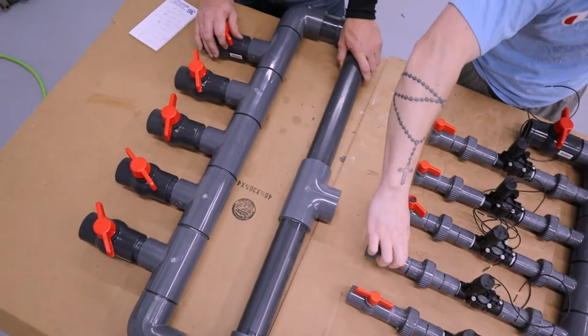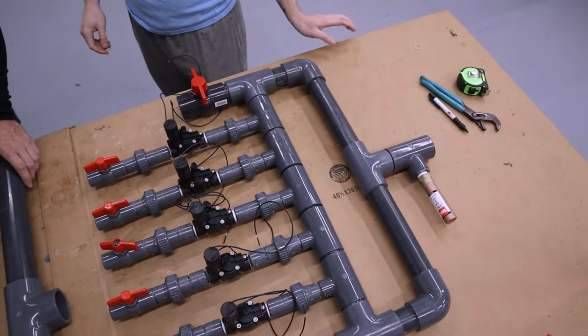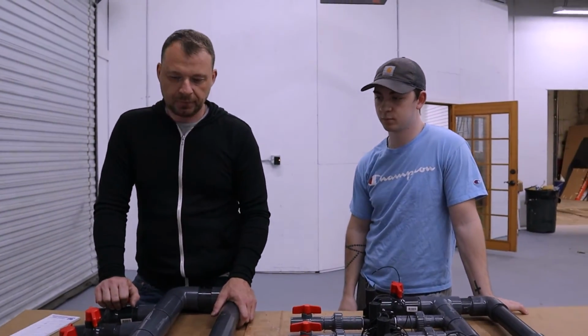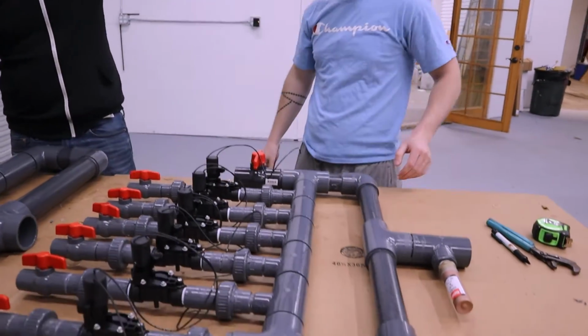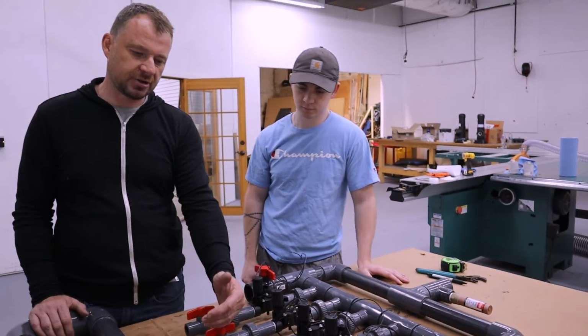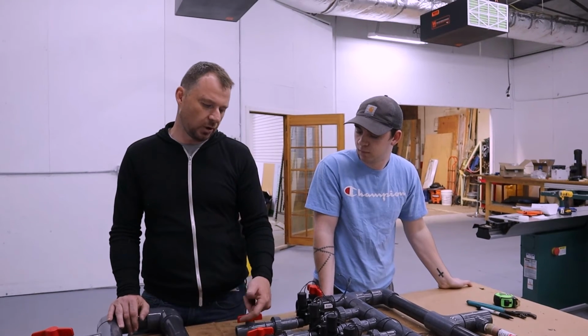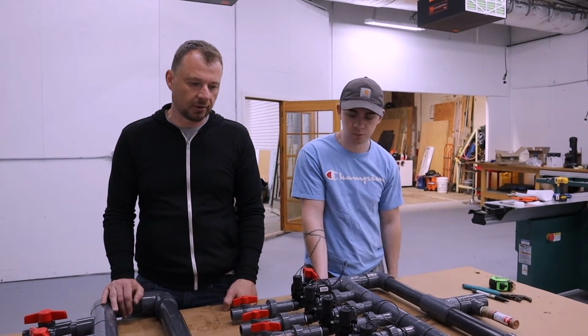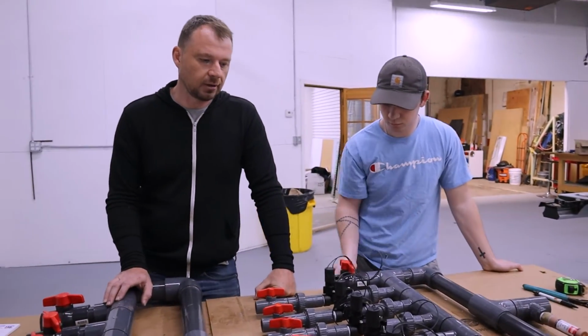This one's definitely bigger. It's 2-inch piping, so it's for better water flow, but we have 1.5 inches pulling out of each one of these shutoffs going to all our fixtures. So you're gonna need higher flow through this one. This one is 1.5 inch piping primarily, and it drops down to 3/4 inch, and then we're going 3/4 inch out to our spray nozzles. And like I mentioned in the last video, we're gonna do 2 nozzles per solenoid valve, so we're not robbing a lot of water pressure. You can have 3, they recommend 3, you can do up to 4. If you do 4 fixtures, I would size it up to 1 inch piping versus the 3/4, just for a little bit better flow, which means you'd have to up your solenoid size too, which Irritrol does make a larger size as well.